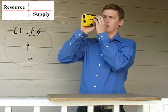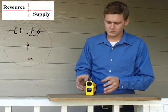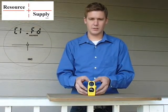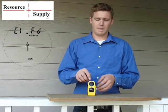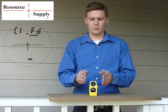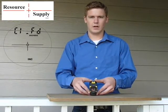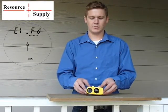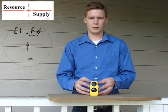This is where the screen looks exactly the same as the compass calibration — the C1FD. It's similar to the compass calibration in that there are eight different positions where you'll place the unit and take different calibration points. It's going to be lens forward and away from you, rotate 90 down, 90 so it's back at you, 90 up, and the same rotation with the serial port up. Go ahead — I'm going to take my first point.